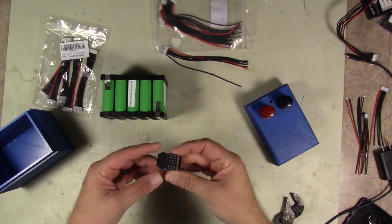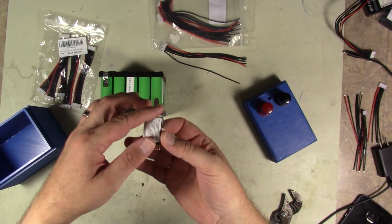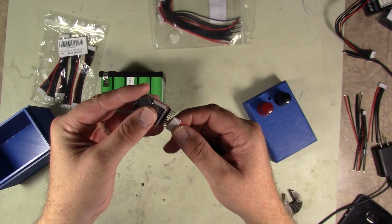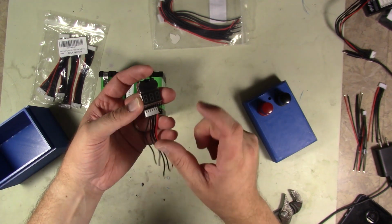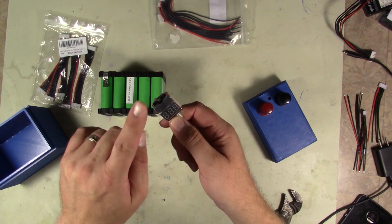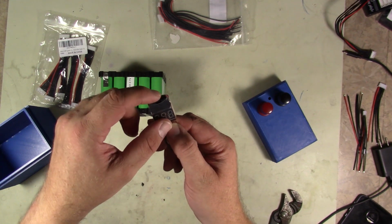Another little piece of equipment that I'm going to be using is one of these cool little low voltage detection circuits. Link down in the description. What these do is you basically can take your balance leads and plug them onto it, and it will measure the voltage across each cell, and it will let out a squealing sound on these little squealers up here, basically piezo speakers, when it falls below a certain value, and that value is programmable.